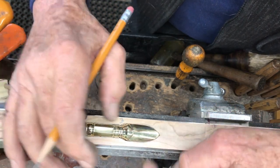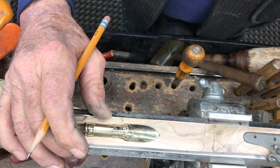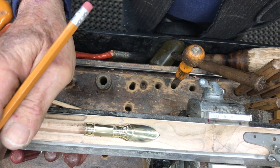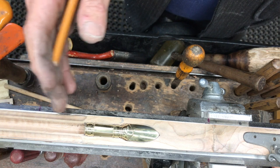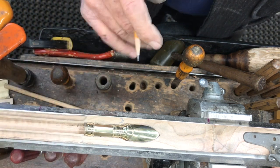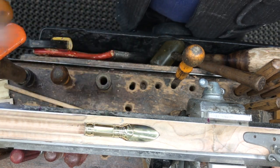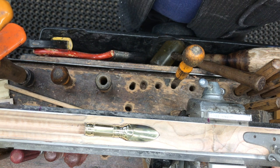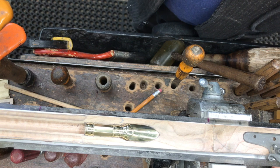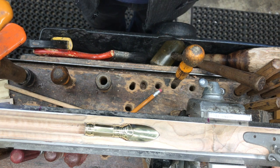So now that it's all in, the epoxy or the glass bedding, the reinforced glass bedding by the way, is in underneath here. It's strong enough, and it probably would be strong enough without the glass, but for a hunting rifle, I think it's a very easy thing to do, and it gives you a lot of insurance. It'd be terrible to take your rifle apart someday to clean it and then break it off here. So that kind of reinforces that. Now, we just go ahead and do the other two thimbles, and we've got one thimble now that we re-bed because we had some voids in it. So I think we can go back and take a look at that now and pull that thimble out and see if we've closed those voids.